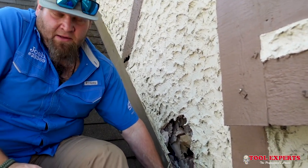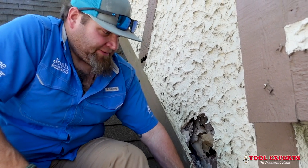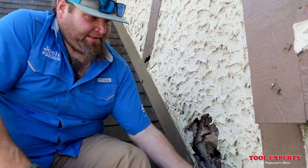Not having clearance on the flashing, everything is just rotten. The counter flashing is rotted through — they're going to need a new roof eventually, pretty quick actually. That's why you've got to make sure your stucco is installed correctly. We're going to wrap up the video there.